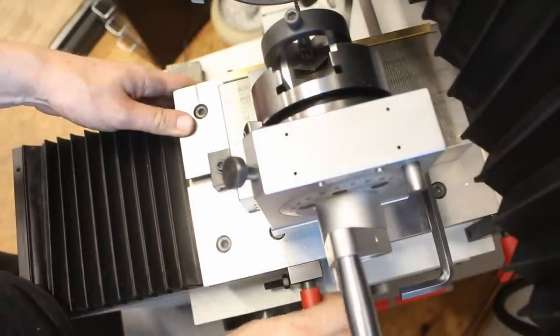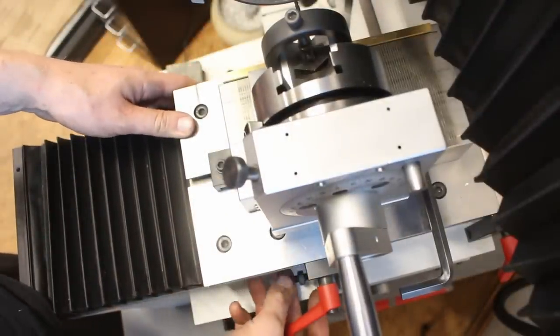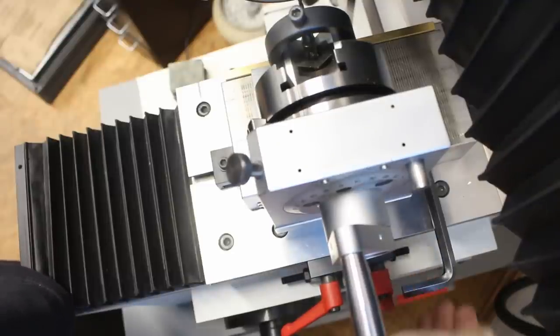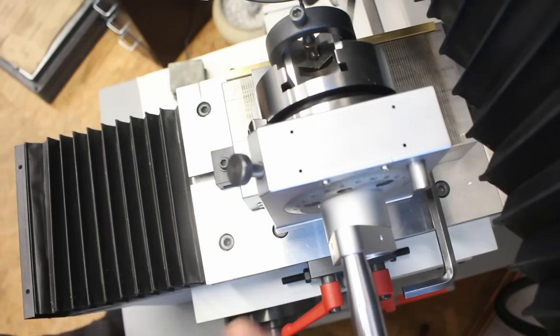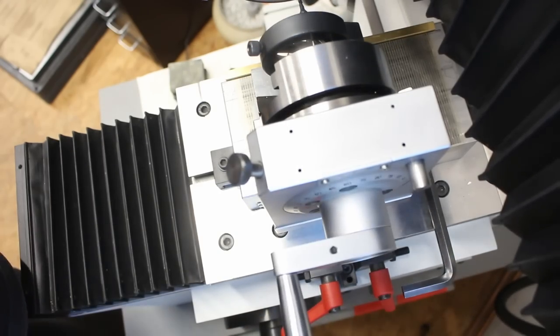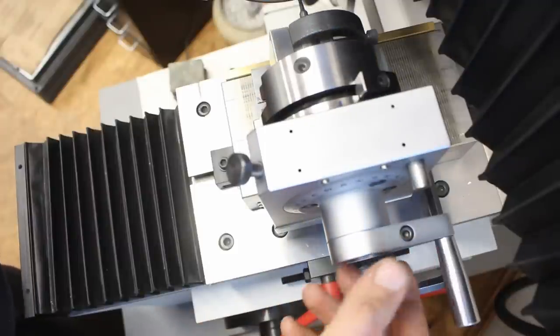And set at least one table stop so we can come back to this position if needed. Then we move the second stop in and just use the adjustment screw to lock the table from moving. Now we have a very nice cylindrical grinding setup. Another little project will be to make a small pulley that goes on here so I can